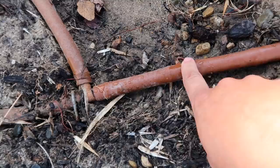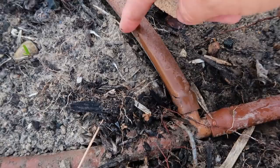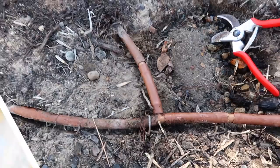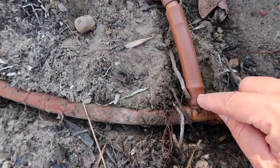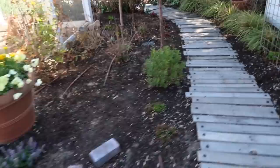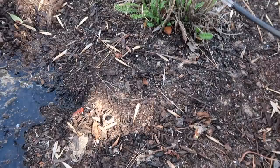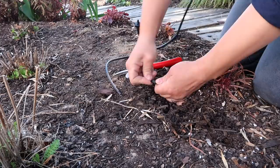I think what happened was because I fixed this one, it created enough pressure to unearth a little nick right here. So what I'm going to have to do — because this is a T connector — I'm going to cut the tube off here, put a straight coupler in, and then put a new piece of tubing between the two. The camera shut off mid-repair, so let me show you what it looks like now: I cut that piece of tubing off, put a new piece on this connector, and connected the two together with a straight coupler. Easy peasy. The water's back on, everything looks good here. There's also a quarter inch tube where the emitter just blew — I had a container sitting here last year so I ran some drip to it, but I won't put a container there this year. So I'm just going to cut this off and plug it.